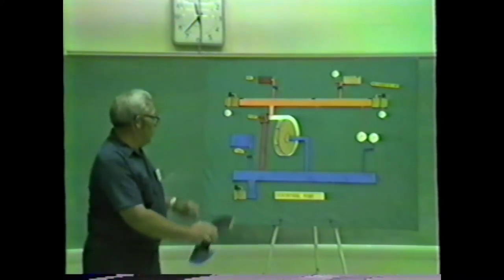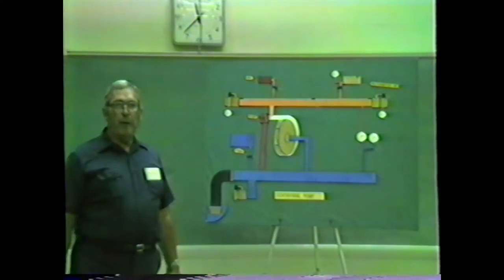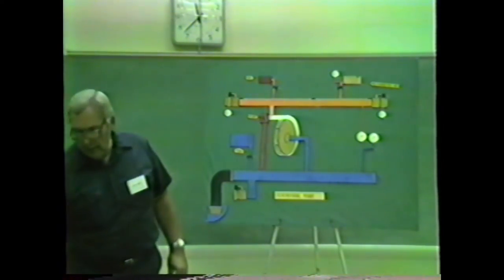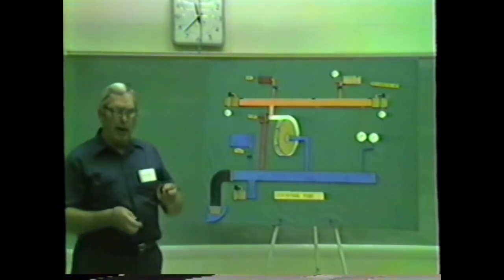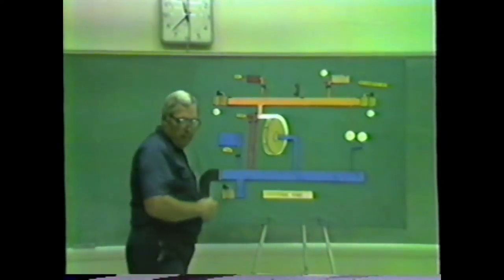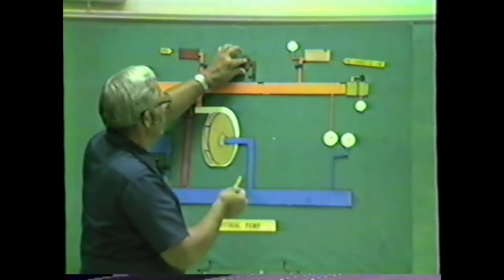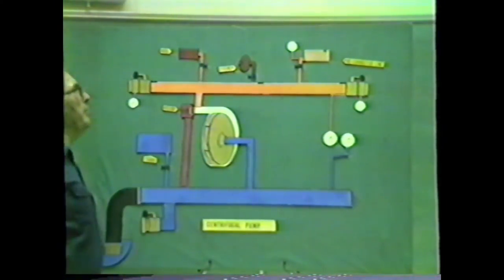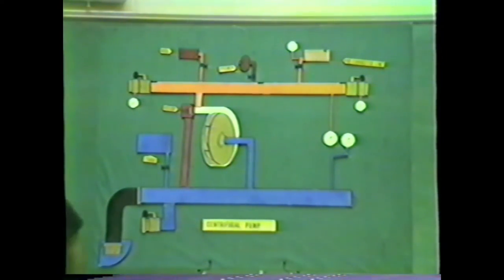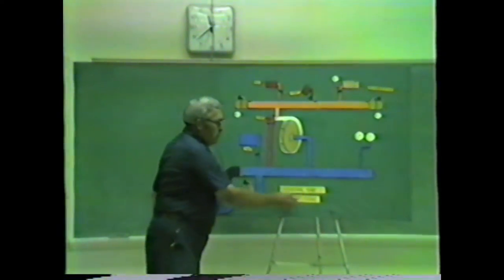Suppose we wanted to get water out of a creek — a static source of water. We cannot do it with the pump as it is, because a centrifugal pump will not pump air. Right now we've got a pump full of air that we need to remove to create a vacuum and draw water up. So we must have a priming device. Anytime you use a centrifugal pump, you must have a priming device. There must be a valve located between the pump and the priming device. The priming device itself is a small gear pump — a positive displacement pump that will pump air. When we operate the primer, it draws the air out of the pump and the water comes up and takes its place. We now have a complete, single-stage pump.